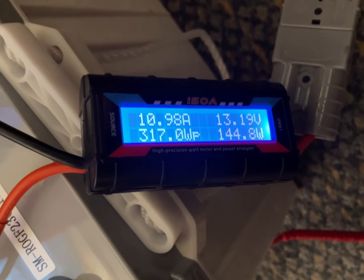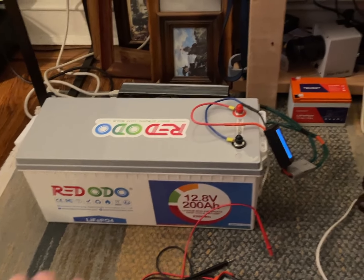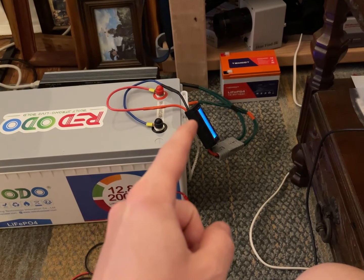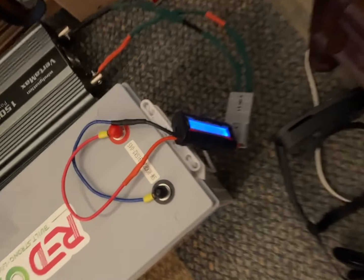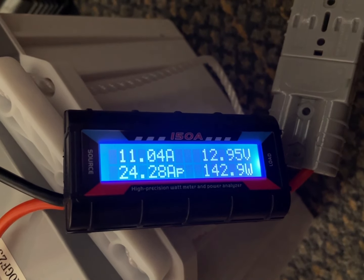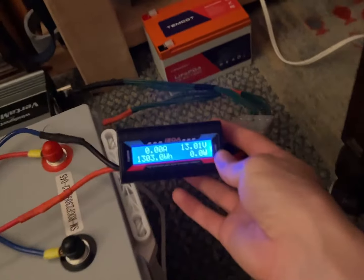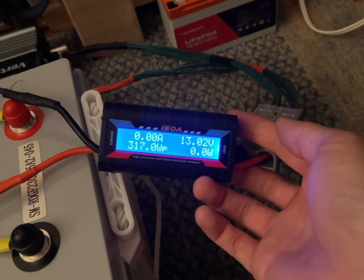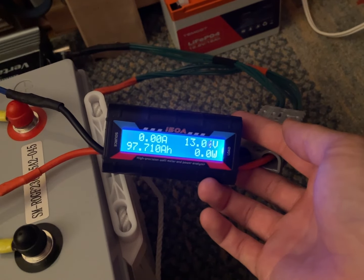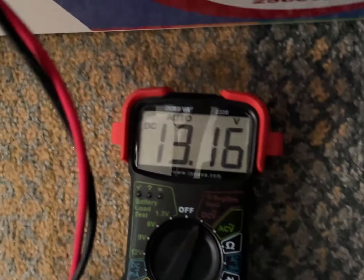It's the next day. I didn't end up turning on my computer in the morning because I had to sleep in, and after working a full day I've returned home — it's time to have some power. Let's see what the power is at. It says 13.28 volts, but let's check. 13.33 — so it looks like we're about 70 to 80 percent charge. Time to get going. We're at 48 amp hours now — I'd say this bodes well. I hope we can get more power out of this.